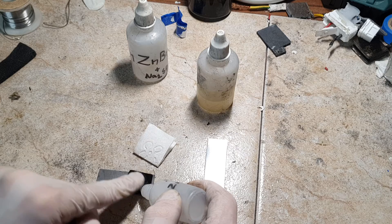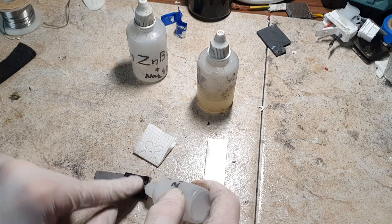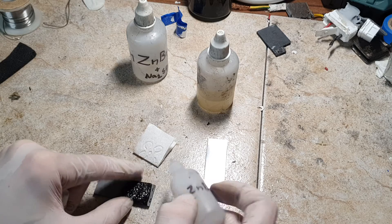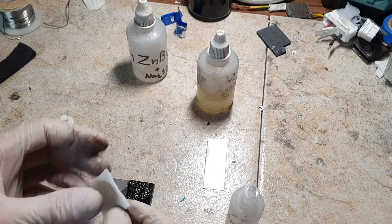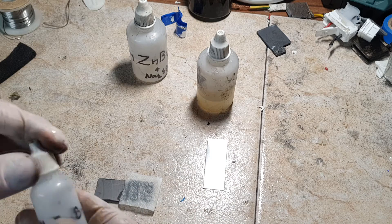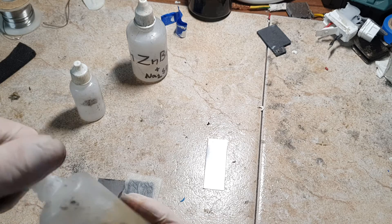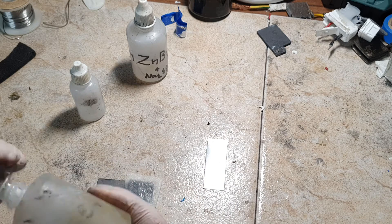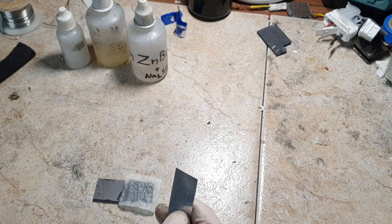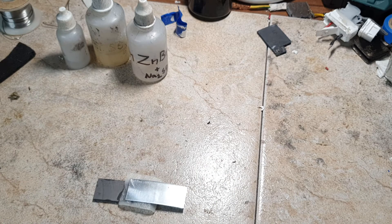You can see it's a little bit hard for this activated carbon felt to soak up the electrolyte, that's why I need to help a little bit. I'm adding the separator, 2 molar of zinc bromide, and now I will also add several drops of zinc sulfate for extra supporting electrolyte. You could also add some bromide complexing agent here, but like I said I don't have it, so I will make this cell without it.